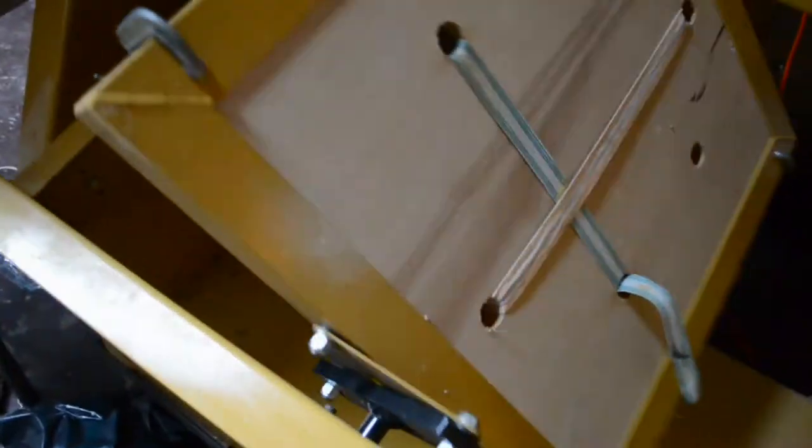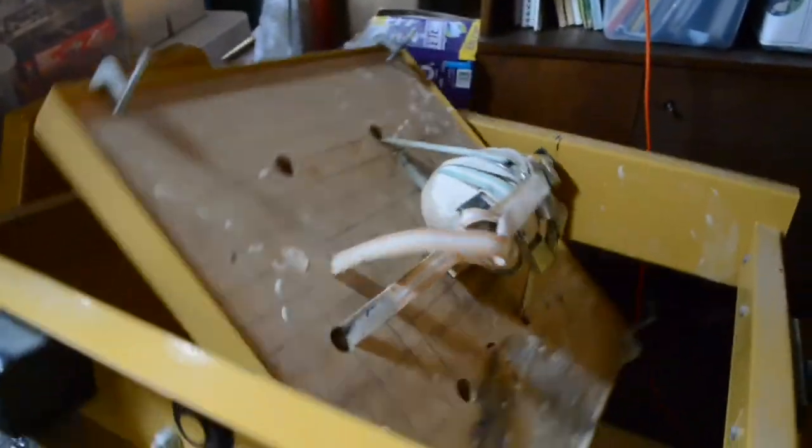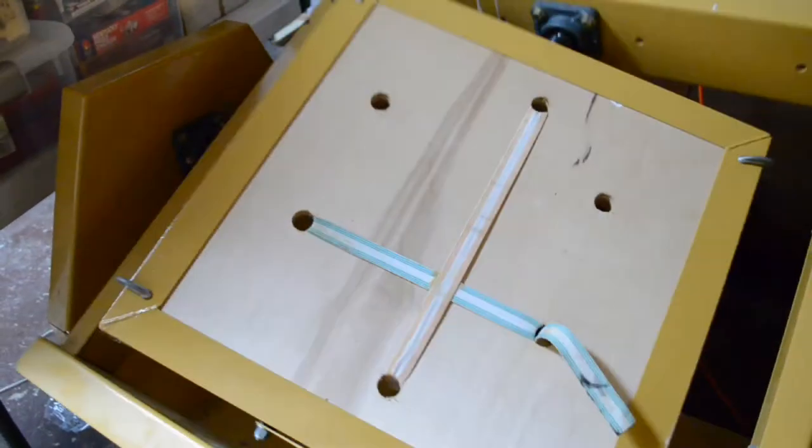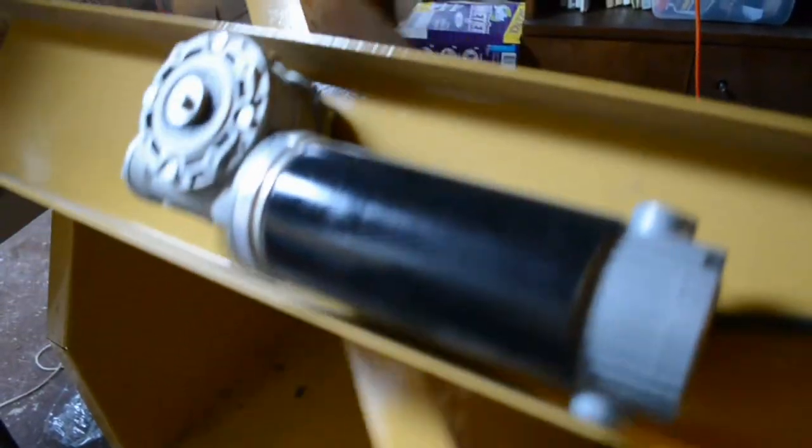and then put the entire rig on the machine, strapped it to the surface before any resin was poured. I then poured the resin from the funnel down into the hole opening of the horn, like I did the first time. Plugged it with the soft, warm clay immediately. This time I used 3 ounces of A, 3 ounces of B. So this is a 6 ounce pour. This will be a hollow cast.